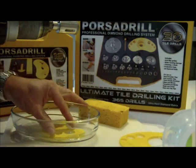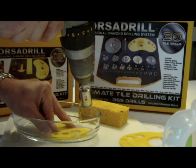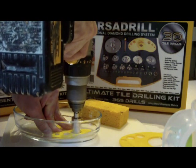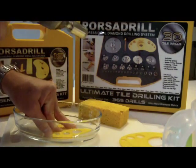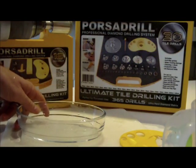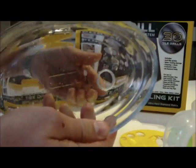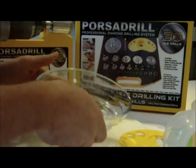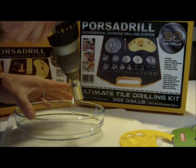That Pyrex bowl is going to hold the water, which is quite handy but not totally necessary. I'm looking through the bowl and I can see exactly where I need to hit, and I can start to re-drill. So inside the bowl on just a little half plate, I have made a start onto the hole. The reason it's going so slowly is I'm taking my time to show you everything. What you see now is that I have made a start from the other side — I'm heading towards the middle, which will give me less breakage. So it's time to finish the job. I've refilled it with water to keep things under control, and then off we go.